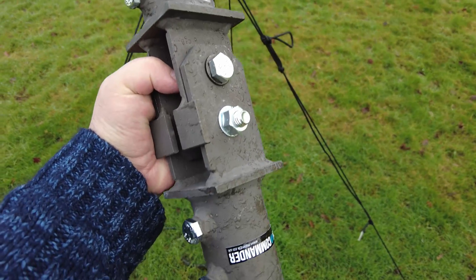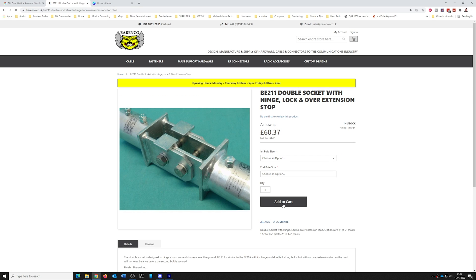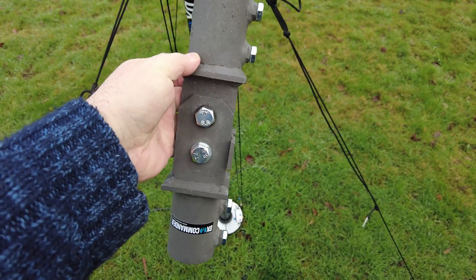Today's project is all about converting the antenna field guide system with this tilt-over hinge. To put a tilt-over hinge in, we also need a ground plate, so we've got to make a custom ground plate. I've got this from Barenco, and Brian said it's pretty special — you can tension the hinge as much as you want, so when it tilts over it doesn't fling. It goes down in a controlled manner, and it's also got stops on it, so when we put up the 12.4 metre pole it won't go all the way over the top.